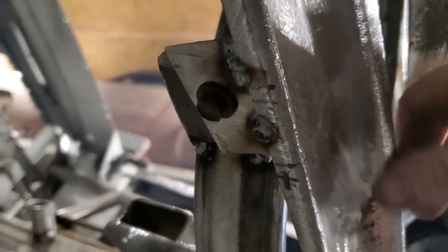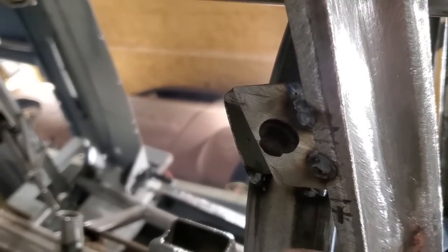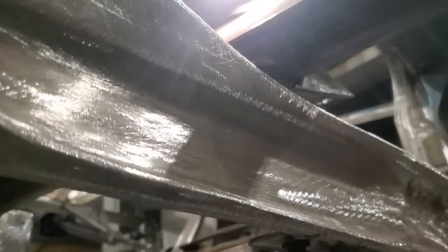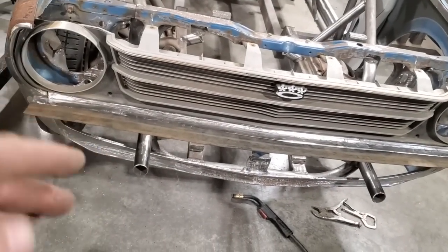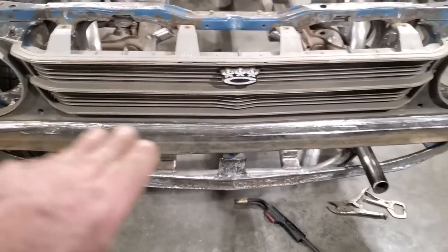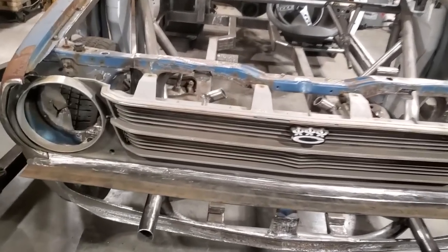There's the tab — you can see I've got a bit of a gap here now. I've just pulled out a small bit and I'll weld it down onto that. This bracket is welded onto the roll bar. When I take this apart, I'll weld all this up and dress the edge on this here, and I'll do the same on the other one — make two of them look nice. I've got the other one done the same way too, over there. There's a bit of a gap now between the bar because this was actually touching the bar, so I pulled out a small bit and it's nice and solid there now. I've got the grill laid in there and the rubber mat across the front — it tucks underneath the bumper and the bumper comes back over there. The biggest thing is making sure those corners are right. I had to tweak it a bit because all this here was up and down, it wasn't even with the grill. I had to pull up on it a few spots. You'll never notice that going 100 miles an hour.